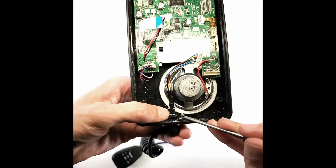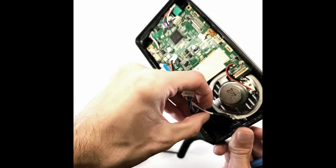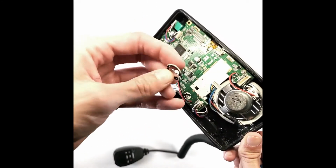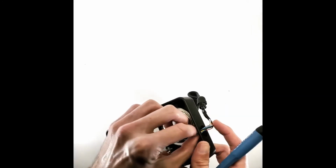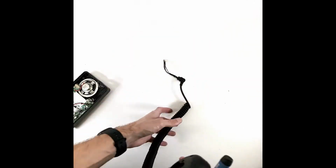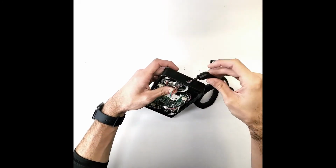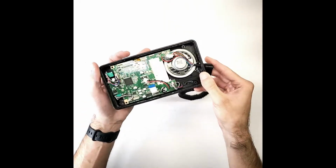Scrape away any sealant where the existing mic cable enters the front panel. Once cleared away, gently pry off the metal lock ring. Once the lock ring is off, pull the cable and connector through the hole and set the cable and hand mic aside. Then, pass the Max Marine Electronics cable and connector with the angled strain relief through the hole.